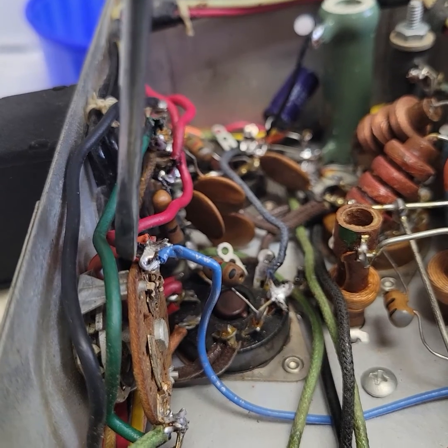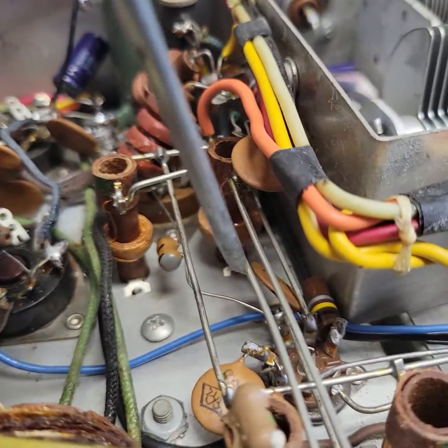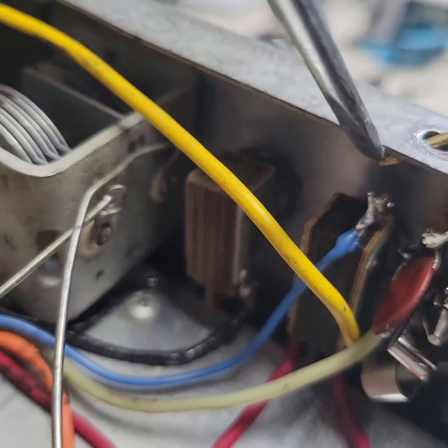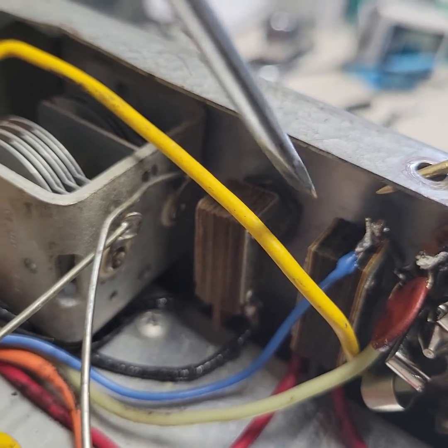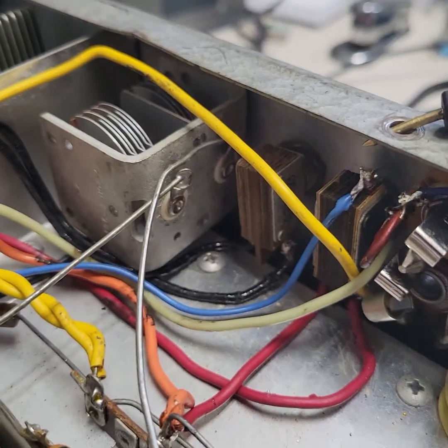There's a red wire, as you can see, going there now. That's feeding from pin 11 on the power connector. I ran the new wire right across and over to the top of the switch. That's all we need to do, and it makes the VFO very, very strong — you can hear it very easily in the receiver.